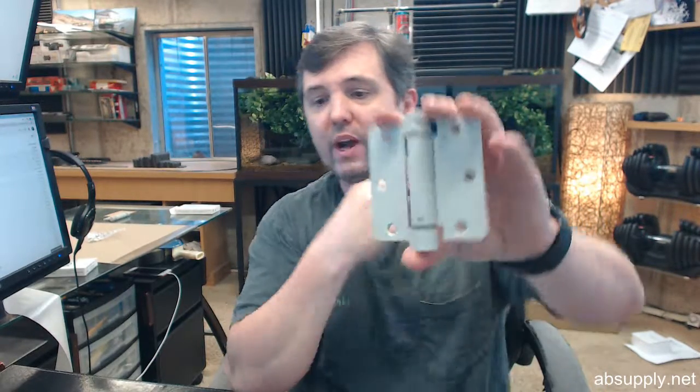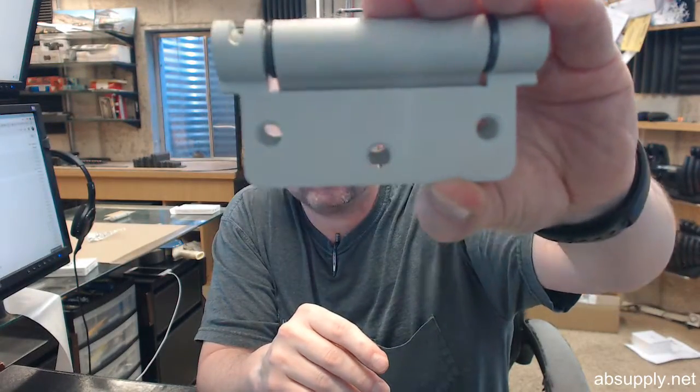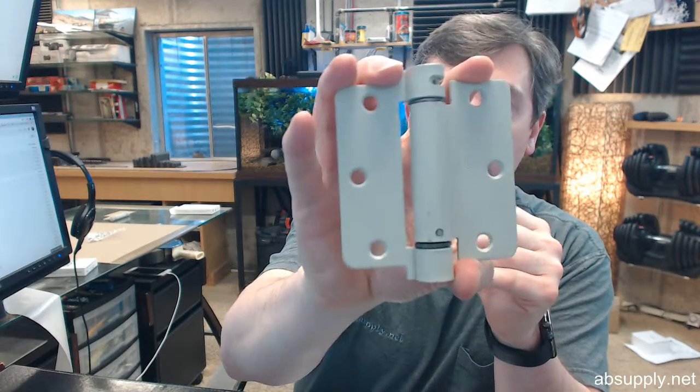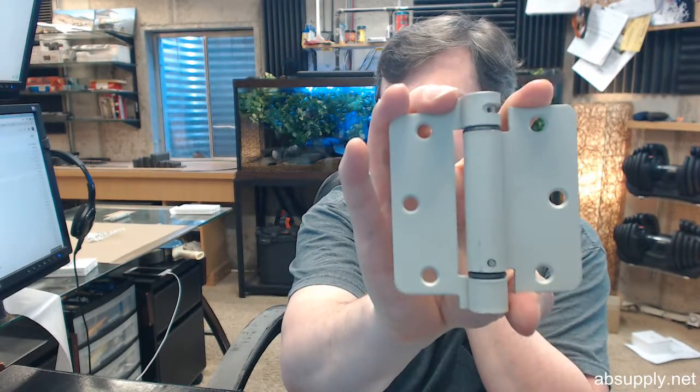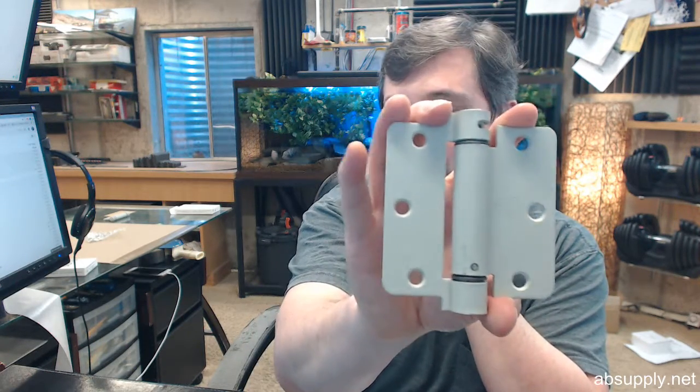This is a grade 1 hinge, which is rated for 1,000,000 cycles. There is a stamping that's on the hinge leaf, and there's an image below this video showing what that says as well. These are non-handed. They can be mounted for either right-hand doors or for left-hand doors. This is what's called a self-lubricating bearing. It's a maintenance-free sort of bearing construction from Bommer. That's the LB part again. Easily adjustable spring tension. We'll go over setting the tension in a moment.